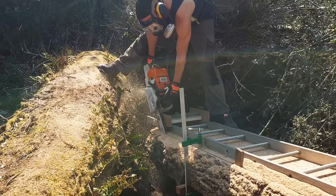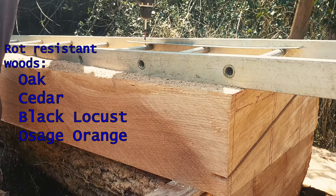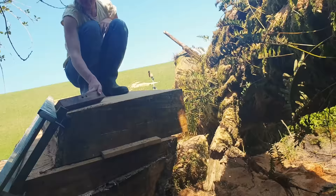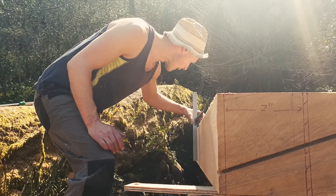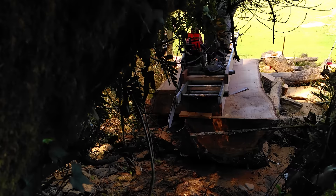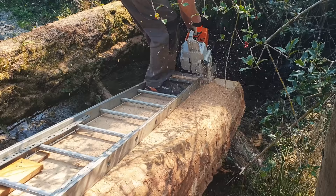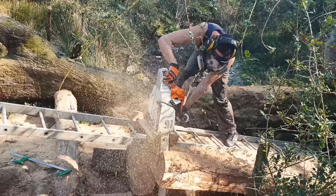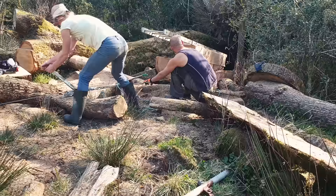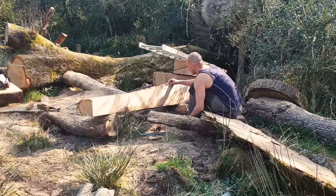Why else might you choose a wood like oak, cedar, black locust, osage orange, or any number of other durable woods over some industrially pressure treated pine or spruce? Well, it is cheap, yes, but it just doesn't really last — so unless you really enjoy replacing gate posts and fence posts, it's just not worth it; some of them don't even last five years. By law in a lot of places in the world, pressure treating chemicals can't contain arsenic anymore. As companies have scrambled to create effective alternative chemical recipes — and in the most part failing — there's a lot of variance between what's in the pressure treating chemicals these days, which is why you see variance in how long the posts actually last.